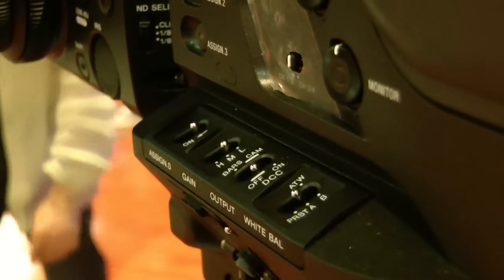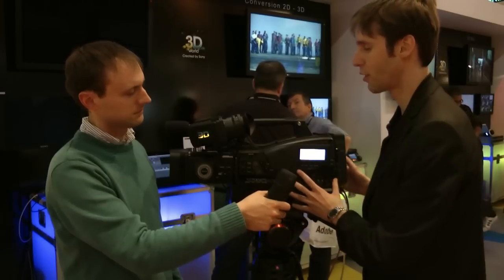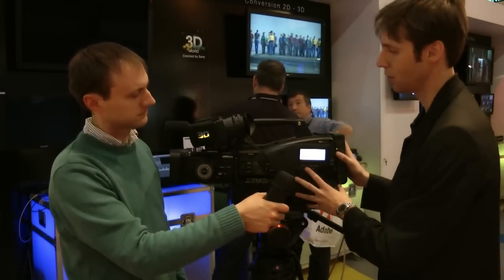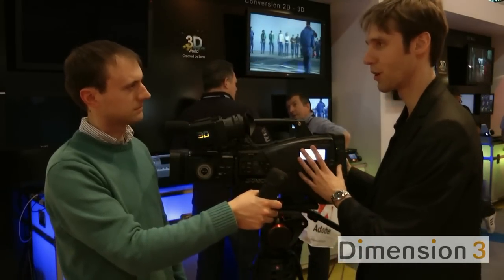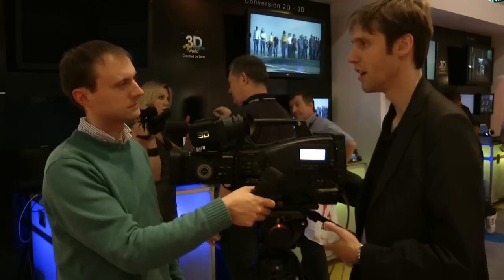This isn't for movies — this is for medium budget productions. There will always be high-end documentaries going abroad with rigs and heavy systems, but there is a need for a complementary solution even on those. For medium and low budget, you have this solution that will be around 30,000 Euro as a target for the European market, enabling people to do a full documentary in 3D with highest quality because it's a half-inch sensor with 35 megabits MPEG-2 recording, while some competitors are stuck with third-inch sensors. In 720p you can do variable frame rate recording, while in 1080 it will be 50i, 60i, or 24p.